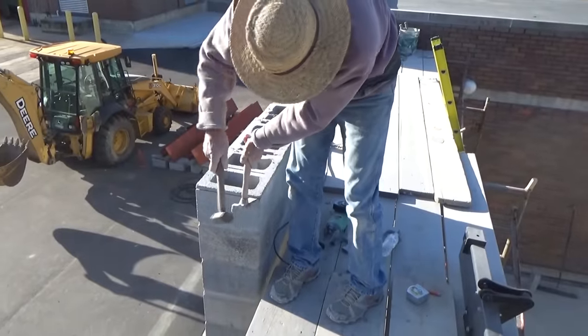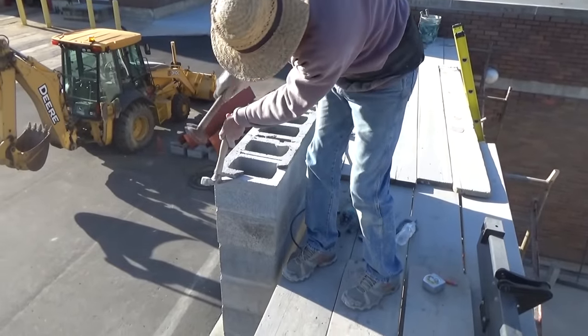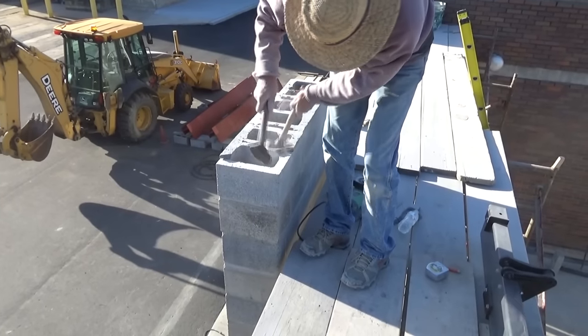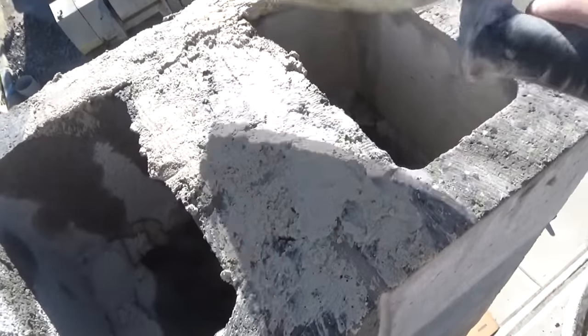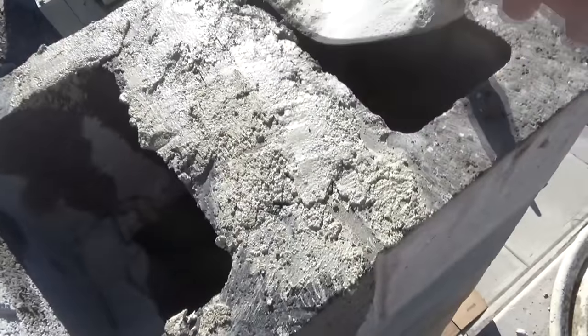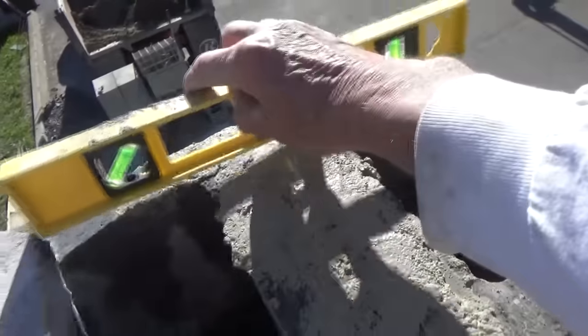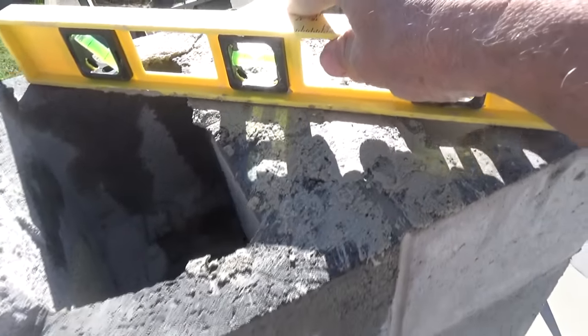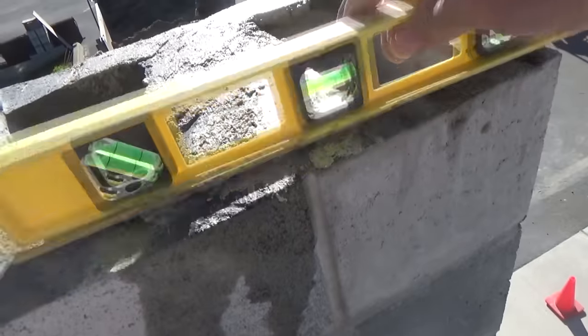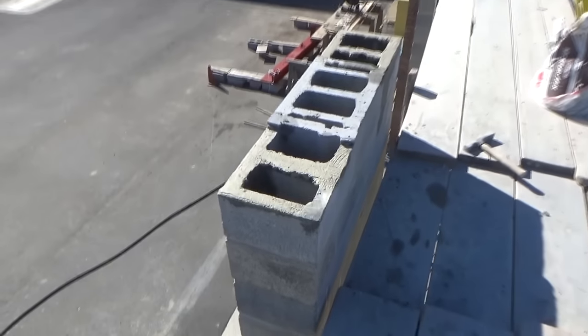We finish sawing and pull it to the right height, just like that. I've got a couple of niches in it, so I'm gonna get some fast-drying cement to straighten it out. Gotta make sure that it is perfectly level going all the way around, because when I lay that beam I want that perfect. I've got my cement on here, everything flat — same thing with each one.